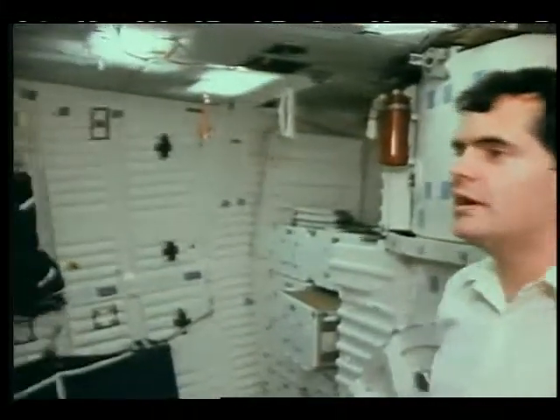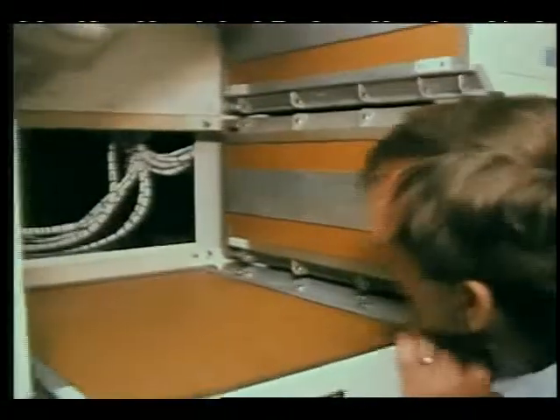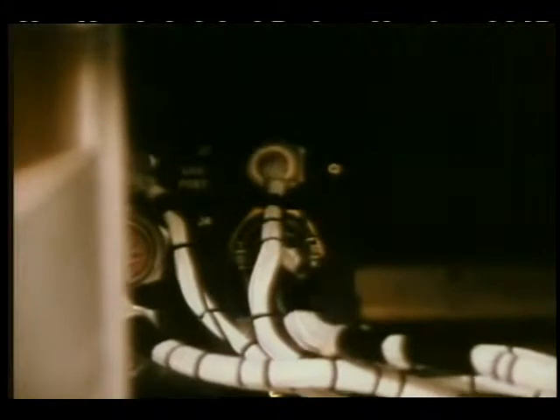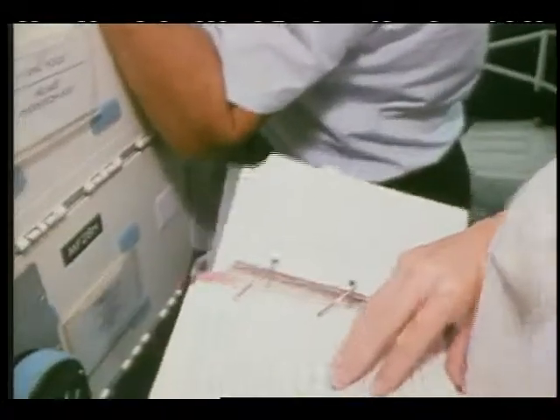There's Velcro down, so you can pull that out from your hand. Now it'll give you access to the avionics bay. Back there you can see the only box that we've actually mocked up in this trainer is the ACCU. Into the J4 connectors on that box — you're going to remove those connectors and then install them onto the ACCU bypass module.